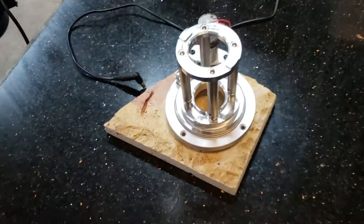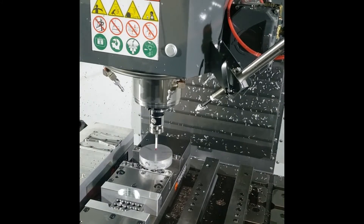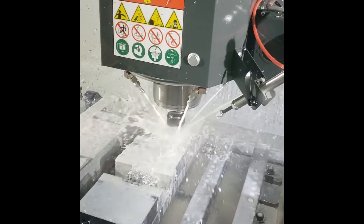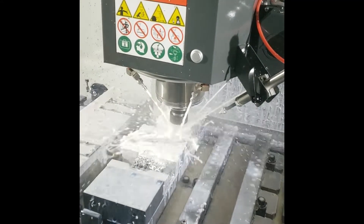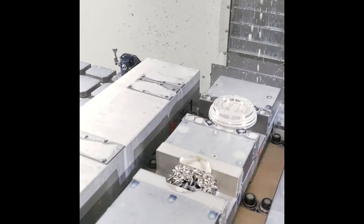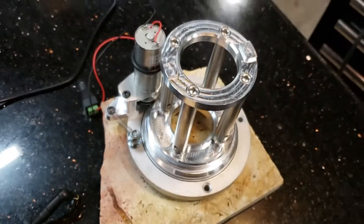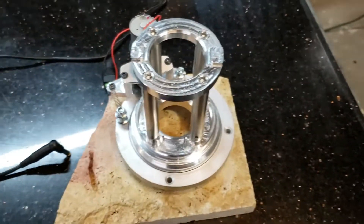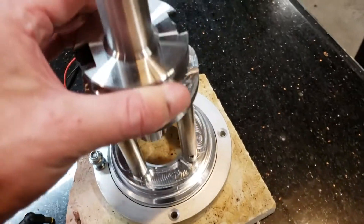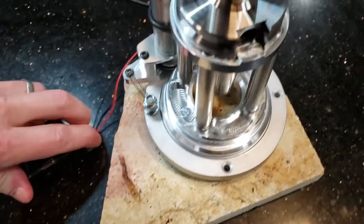This one's just a quarter inch, and this is basically the little spinner I made. The whole idea of this little hacky gadget is just to spin the shrink fit tool when you're heating it with the torch. So a tool just drops right in there — it's one-handed. Plug it in and the motor just spins it.